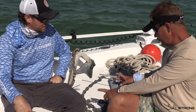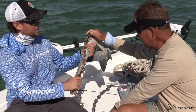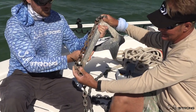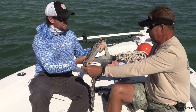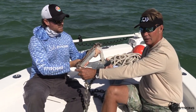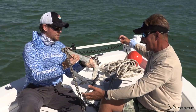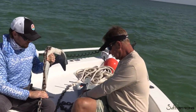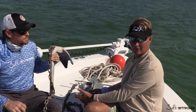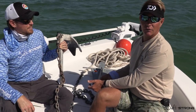Let's talk about a reef trip. When you hang an anchor up on the bottom in deep water, you can't just go down and get it. If you look at what I have set up here, you'll notice a hole with a buckle, and the chain runs down to the end of the shank and is zip-tied right here. The zip ties are enough to hold the boat on this anchor, and if by some bad luck it gets hung up in a rock and you can't pull it, you tighten up the anchor rope to your boat, bump the boat in gear with enough force to break the zip tie, which lets the chain pull the anchor from the back — pulling it out of the snag. Versus pulling from the front, which only puts it in the rock worse. Without a reef trip, diving anchors in the Keys is a full-time sport, because you find anchors up and down the reef hung in the rock where you can't get them out.